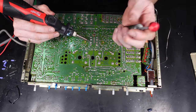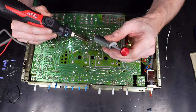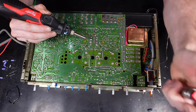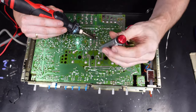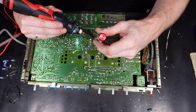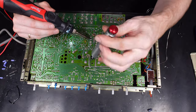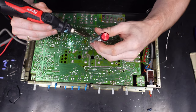As you can see, I'm currently working on the four main capacitors on the amplifier - these ones were also discharged before doing this. They have a little more solder to remove so they take a bit more time. You can see the difference in size between the old ones and the new ones when I come to fitting them - even at the same power rating, the physical size of the modern capacitors is a hell of a lot smaller.